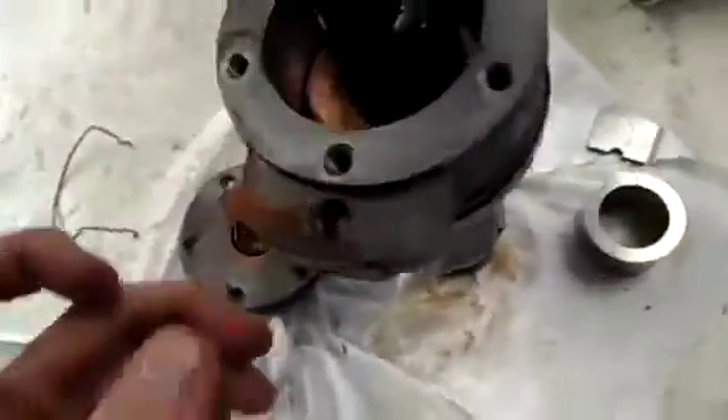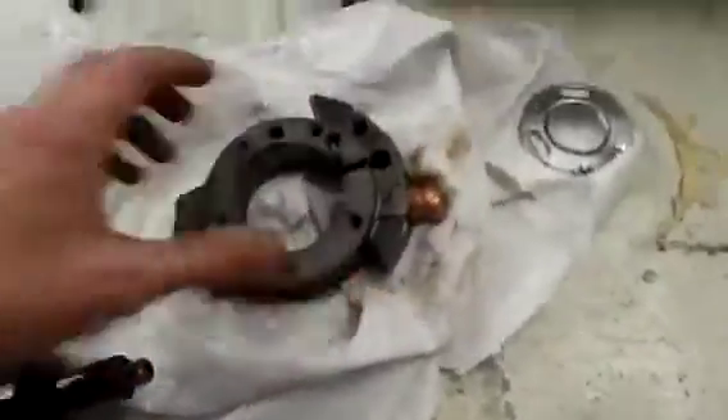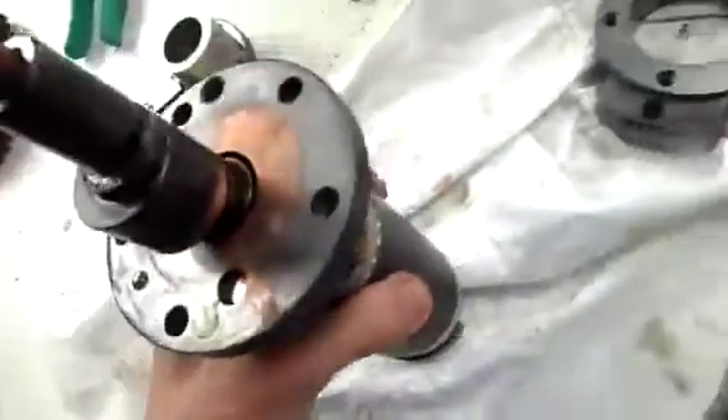The important thing at the moment is to get it off and clean it up as best as possible, get a lot of this rusting crap off it. There's the rotor housing off — it took a bit of work. I actually had to cut the metal plate that was around it that protected the reed valve and everything, which is actually there if you can see that. It's got a little bit of rust on it as well. The motor bearings are all right — you can turn them over and there's no noise coming from them, which is good. There is a bit of play in it which is probably expected for a rotary — I'm guessing it'll all be taken up by the bearing on the other end. There are a few little wear points on it, and there's definitely a lot of wear in the keyway as you can clearly see on its bottom end.